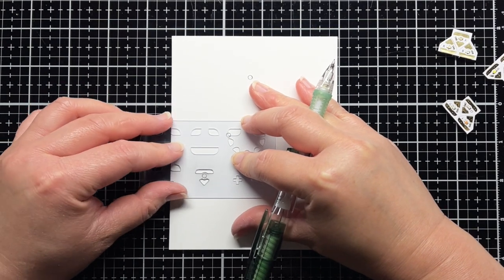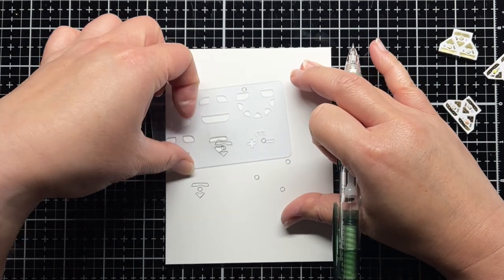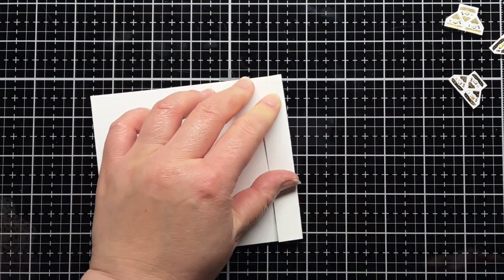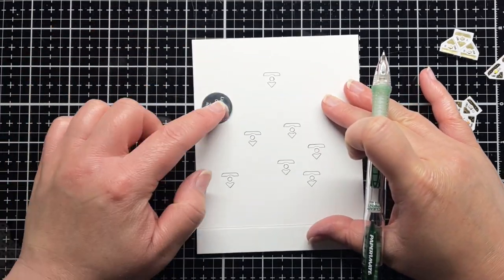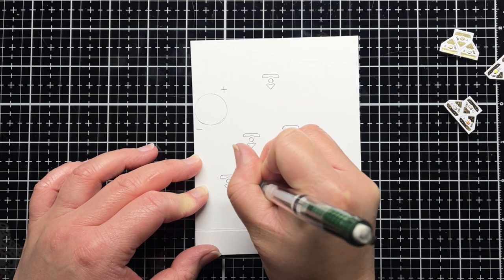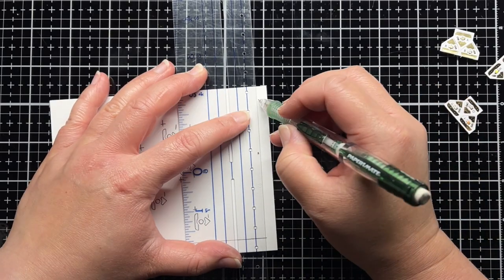To start, I use a stencil to trace the triangular shape around each hole. The negative part of the sticker is the point and I trace the shape with the point facing down — this will show me where my light stickers will go. You can also draw a small triangle around each circle if you don't have the stencil. Next I use my scoreboard to score the bottom of the panel at 5 eighths of an inch. I fold along the score line and use my bone folder to get a sharp crease. Then I trace around my round battery shape on the top left side of my panel. The positive side of my circuit will be on the top of the panel and the negative side will be on the bottom. I mark the positive and negative side of each stencil triangle as a reference. I've been using Chibitronics lights for years, but I still like to trace out my design before I start working just to make sure everything is in the correct place.